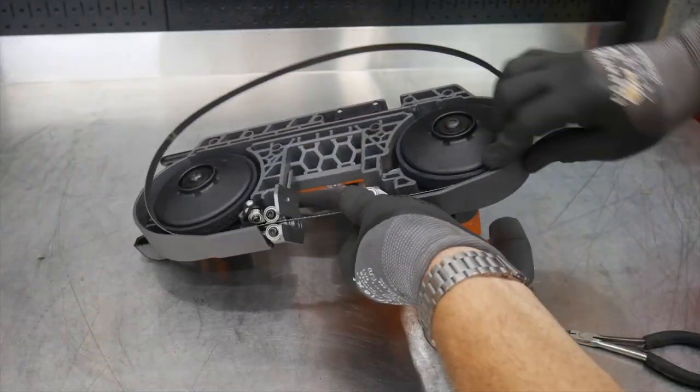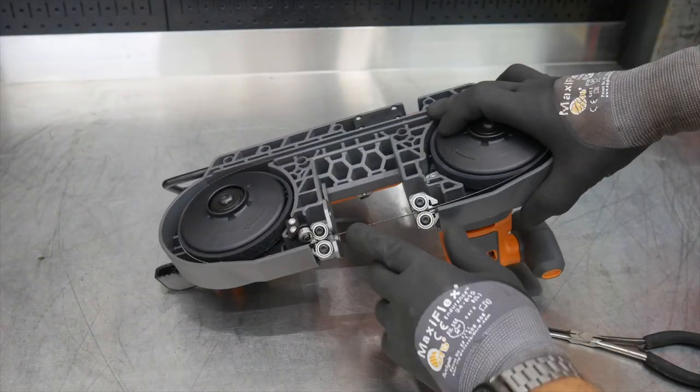Not sure on the tooth count on that blade, but you can get several different blades depending on what you're cutting. We tried it with a two amp-hour battery to keep things slim and lightweight, and it made a lot of cuts with quite a few bars left on the battery. You could run a four or six amp-hour battery too, but it's probably overkill. This is a compact saw — the idea is to fit in tight spots, be lightweight, and carry the saw to your cutting rather than carrying all your material to the chop saw or bandsaw.